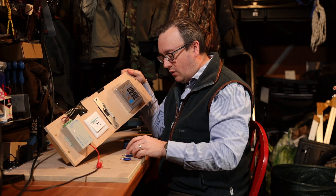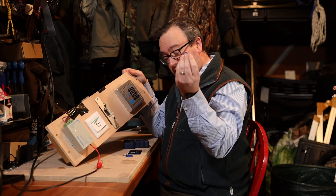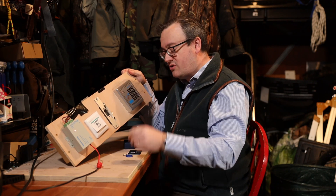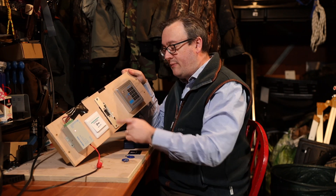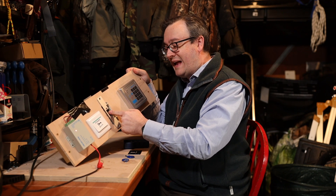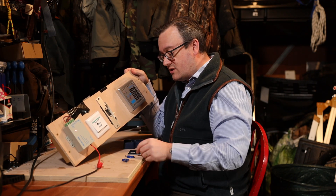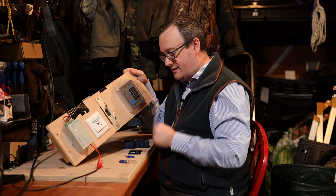So how do these things work? Very, very simply. You would have an RFID token such as this, you would present the token to the reader, and when you present the right token to the reader you get a single bleep and then that latch unlocks. If you present the wrong token — one that isn't registered in the system — it doesn't work.